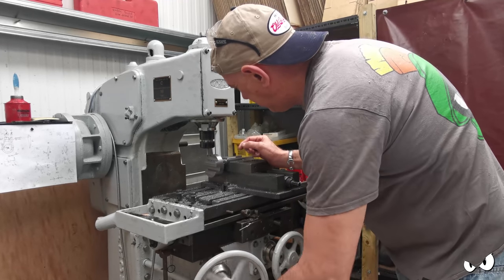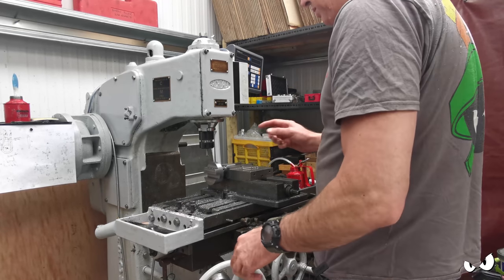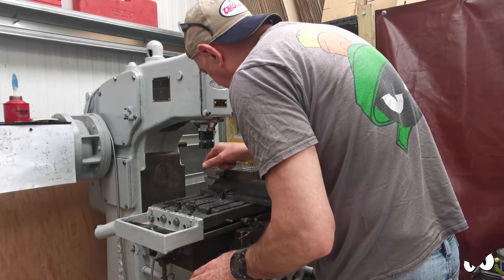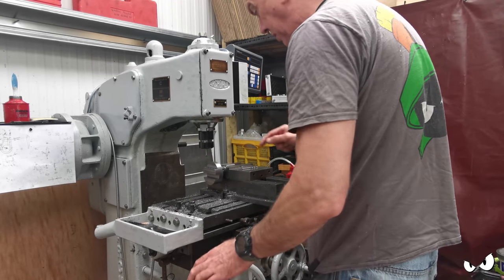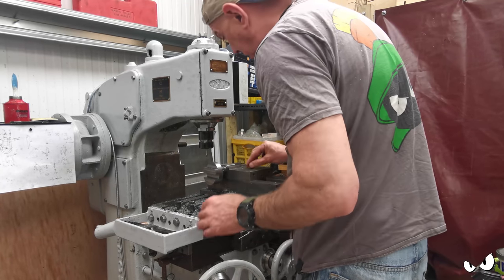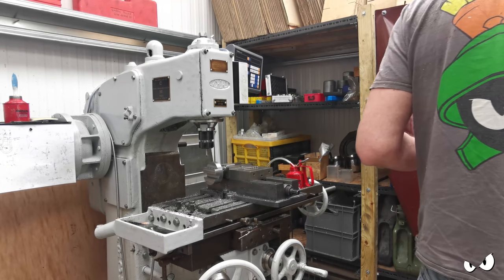Okay, I shoved a bigger round die grinder bit in there just because the other one was deflecting all over the place. And all I'm trying to do is to make a divot in the top of it. You just dish it out slightly. It's a three fluted tap, and I'm hoping I can shove a 3mm cobalt drill through the middle and take the core out, but I don't know. We'll have to see.